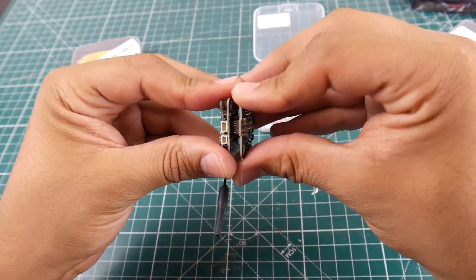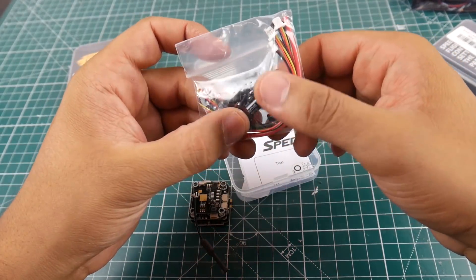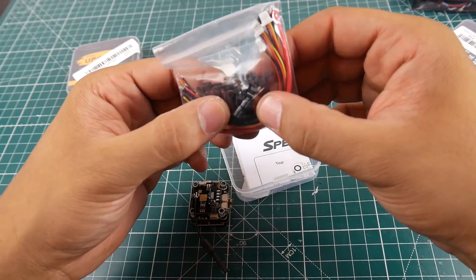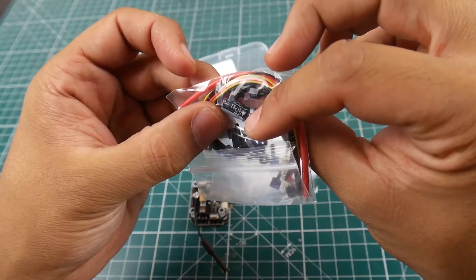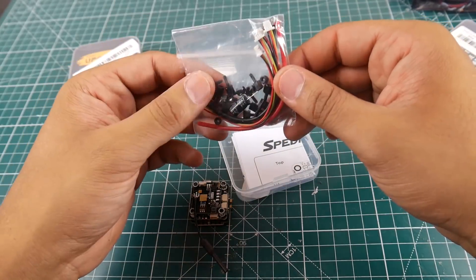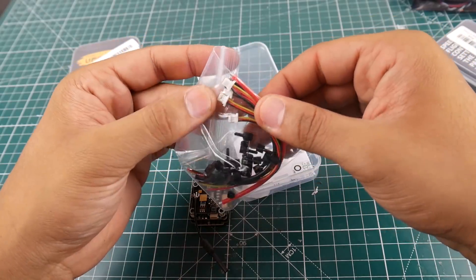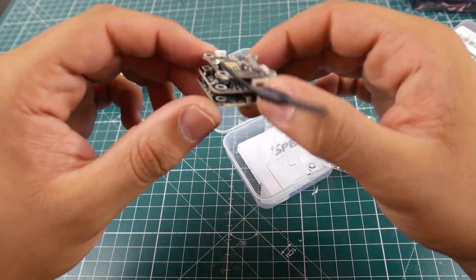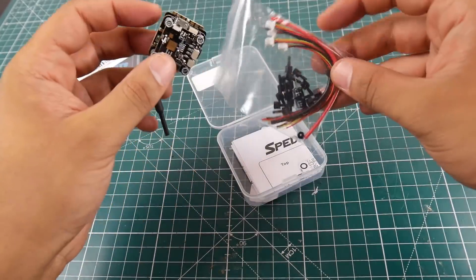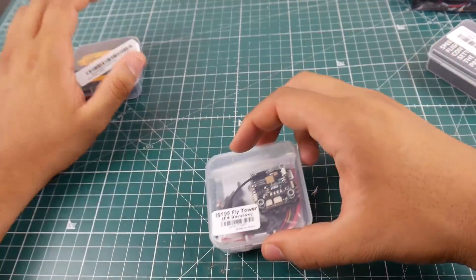What else does it come with? Actually, this is pretty nice — they give you a capacitor. It's a Rubicon low ESR capacitor: 25 volt, 150 microfarad. That's more than enough, but I highly doubt you'll need it — it's always nice to add though. They also give you some connectors, because I think you can't solder directly to this board — everything's via connector, so your connectors will have to be soldered to something. And they do have a little instruction manual, which is very nice to see.